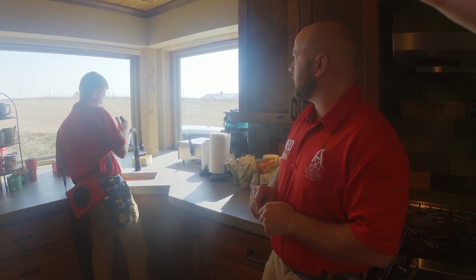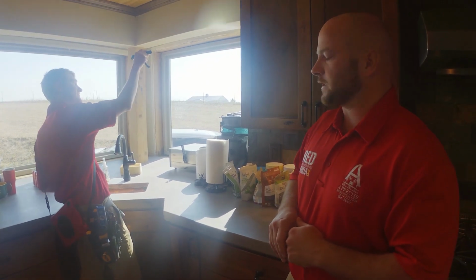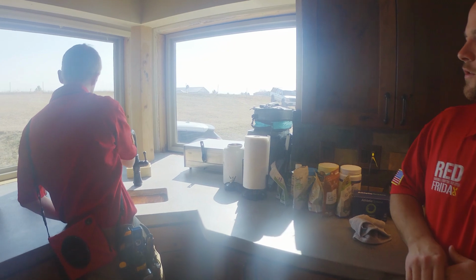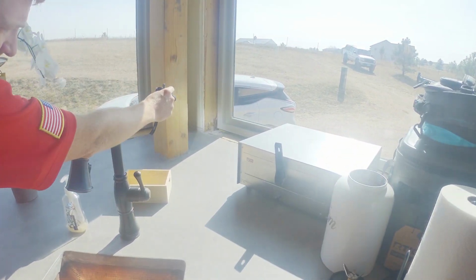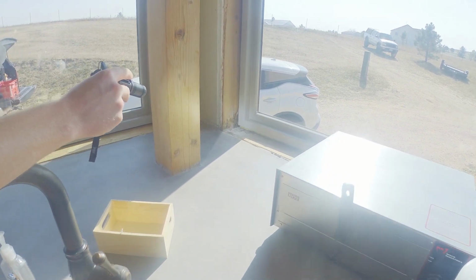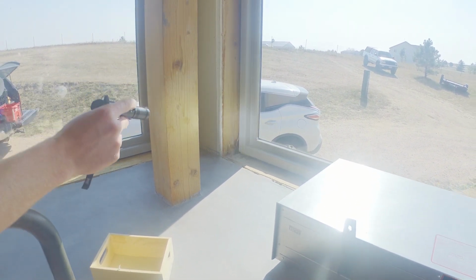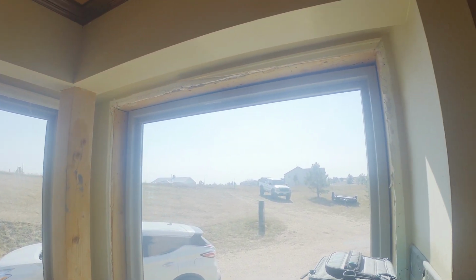So a couple things that we see is that there's no drywall, which we really don't note on. That's just a cosmetic thing, but we might mention it to our clients. But we do see some moisture damage at the bottom corners. With these windows being newer, there should be what's called a pan flashing there, like a rubber membrane type of tape to prevent that moisture damage. So we'll point that out to our clients and note it in our report.